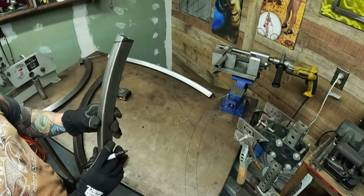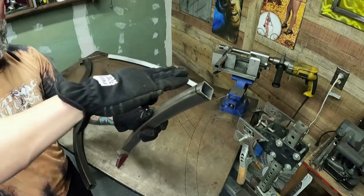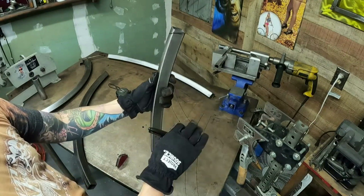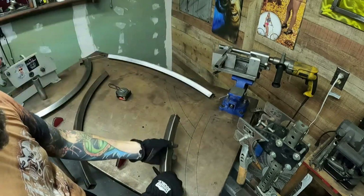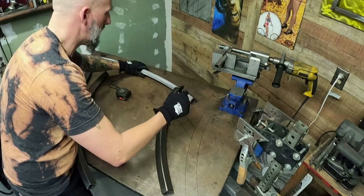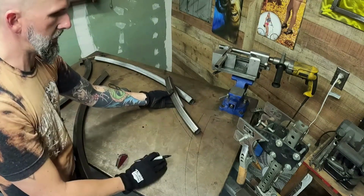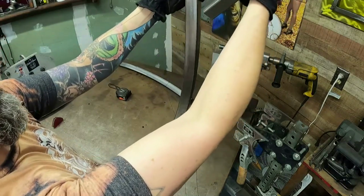Like I said, cool thing about flat tube is that you're gonna just draw a line and then cut through that line and that'll leave you flat. When you're doing round tube, you're just kind of trying to get it as flat as you can on a round surface. This makes it easy. You'll lay this down, you'll cut this directly across like that. It's flat. It'll butt up next to the next piece that'll be here, which will go from there to there. And then these two will just butt up and then you'll shape this so that you'll notch it here and it'll lay right in there.